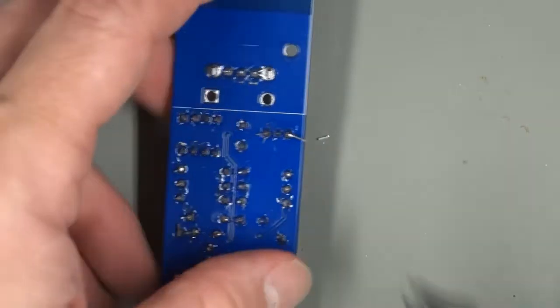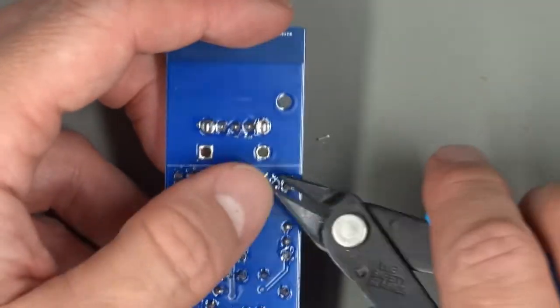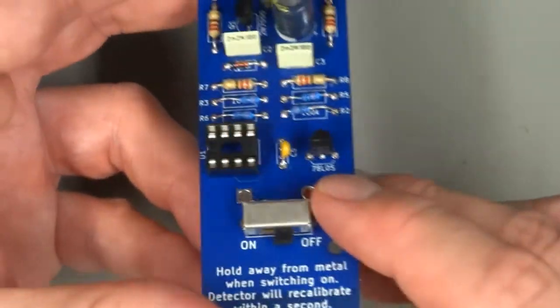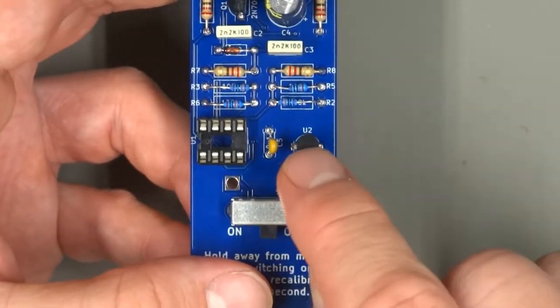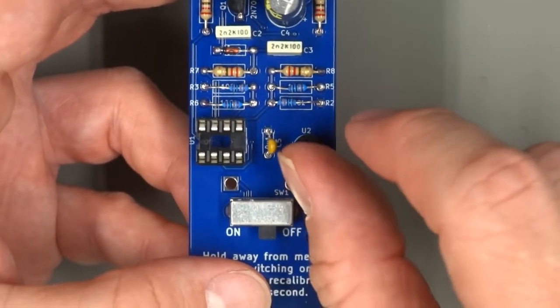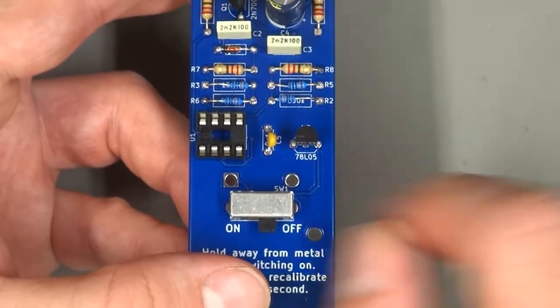These packages do have to be installed facing the correct direction. It's not hard to tell where the correct direction is. In fact, I thought it was so obvious I didn't mention it. But you can see they have a sort of half moon shape, a rounded back and a flat front with the text on it. And that matches the footprint that's drawn on the board.